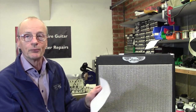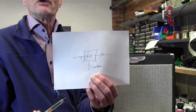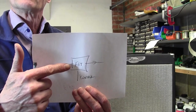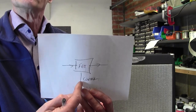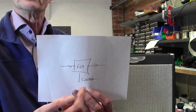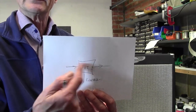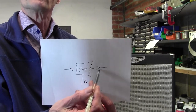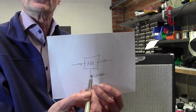I could probably show you just quickly on a piece of paper — a bit of a weird way of doing things. Basically there's just a field effect transistor in the circuit, and the HT comes in and goes out to the amplifier, but only when there's a control voltage on the gate terminal. So if the control voltage is present, the FET is effectively short circuit and the HT goes through to the amplifier. When you ground that terminal, the switch is open circuit so the HT can't get through. Now if the FET is blown — which I suspect — it will be just a short circuit regardless of what you put on the control voltage.